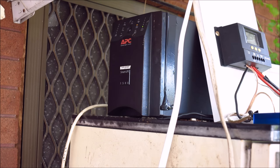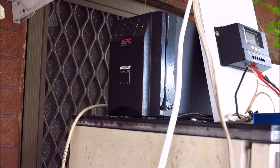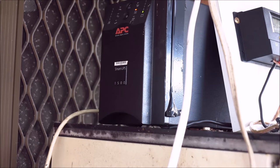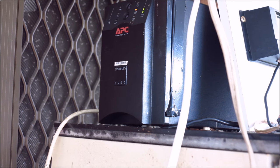What I'm doing to turn the solar power into something useful — which is 240 here in Oz, not like that weak 110 thing in America at 60 hertz. We have real 240 volt power at 50 manly hertz. To do that I'm using this UPS, an APC Smart UPS 1500, which gives us about 980 watts output. I've made an external connection which goes into the unit where the batteries used to be, hooks up on the original DC connector, and then I can run that down to my batteries. The cable I'm using is a little undersized for full power, but I've got some actual battery cables made up so it can really suck the juice in from a couple of meters away.